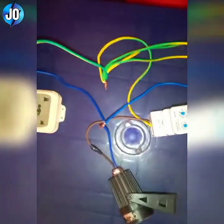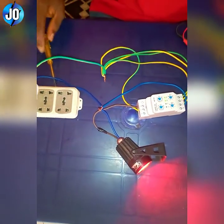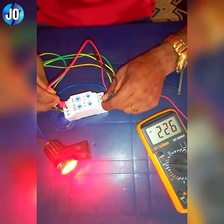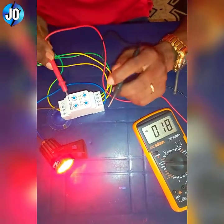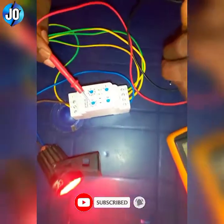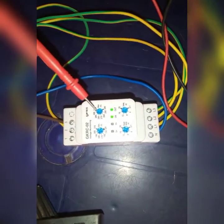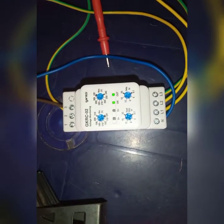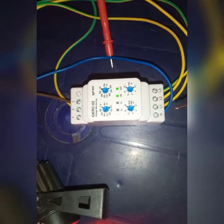So I supply voltage to it. When you look at it now, you see that immediately on, it will supply — meaning that at this point the voltage is okay. When you check the voltage, from neutral to terminal number three it gives you 226 volts, meaning it is okay. This component requires a minimum of 210 volts, which we set it to, and the maximum is 240 — you can set it to whatever you want. You also want to set the delay time. So this is how you connect the voltage monitor and how you use it to monitor the level of voltage. Thank you very much, and thank you for watching.